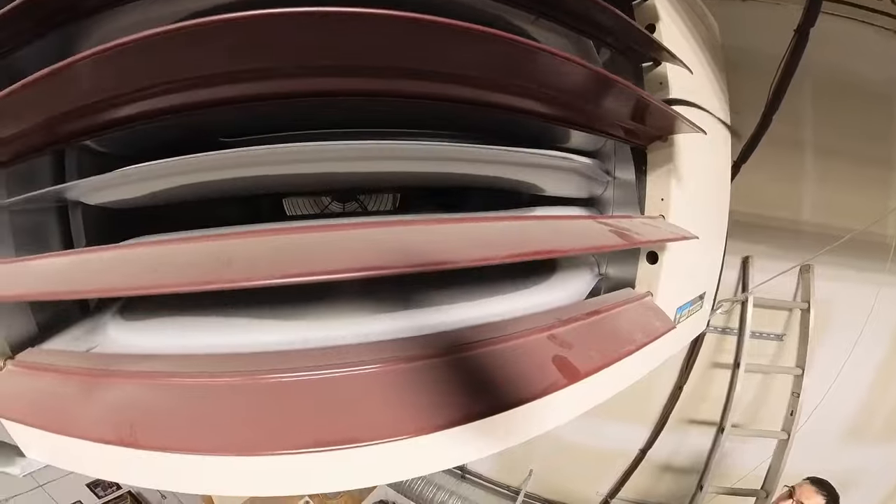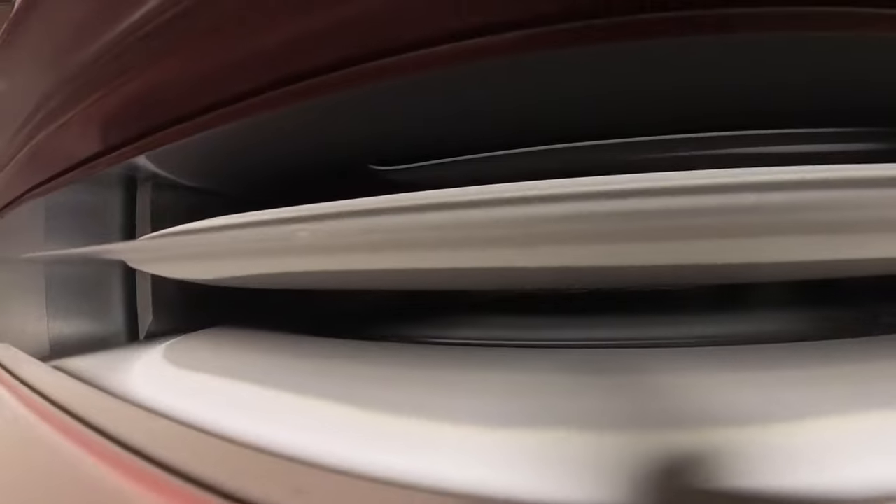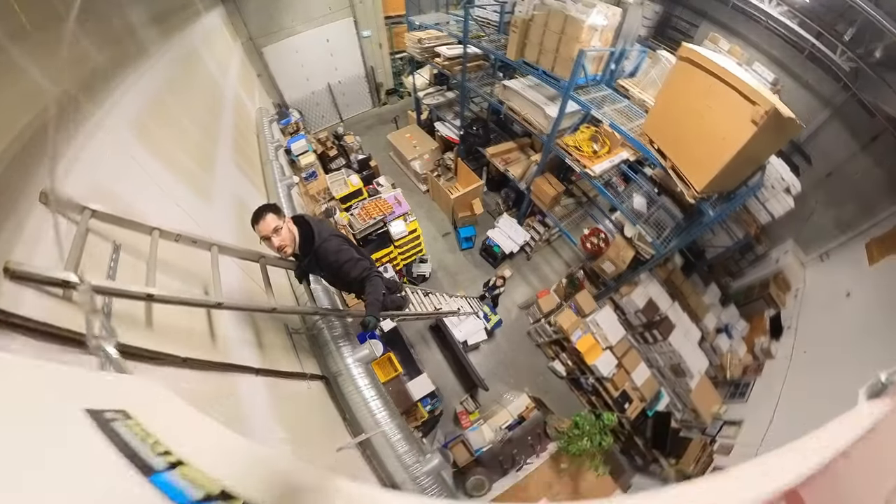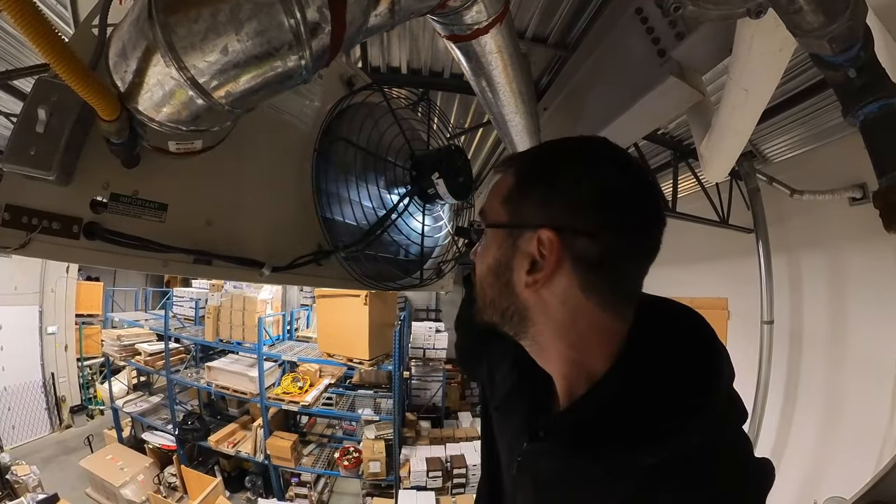We were able to see the flame rolling out of the heat exchanger. Can you see those flames? They're like licking out — you shouldn't be able to see them like that, it should be a pretty steady flame. Because of that flame behavior, we figured there has to be a crack in the heat exchanger. So we used the 360 camera again to try to see what we could find, and we did find a conclusive crack in the back — Trevor got a picture of it. So we have a new unit heater on order.